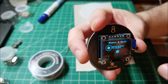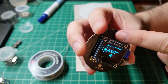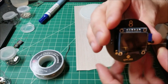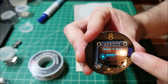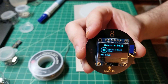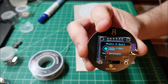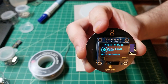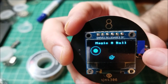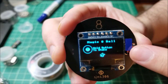It does power up! I pre-programmed the chip using one of those surface-mount ZIF connector sockets. Other than a little bit of excess solder on the top, it went to sleep and turns back on — you can shake it and it gives a fortune. 'Ask again' — the infamous 'ask again.' Let me zoom in on that to show how sharp the screen is. There's a little protective film I'll leave on until I give this to the gift recipient.